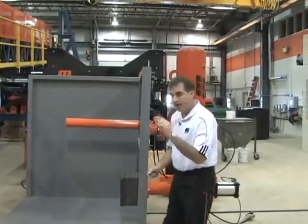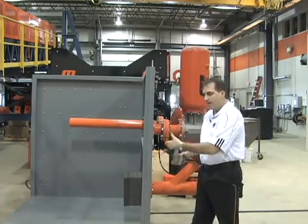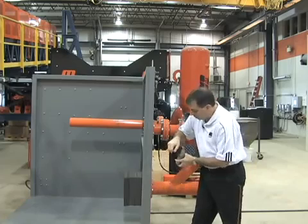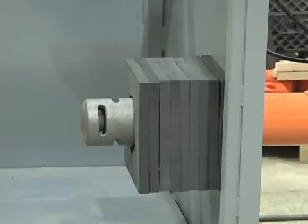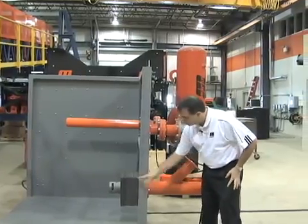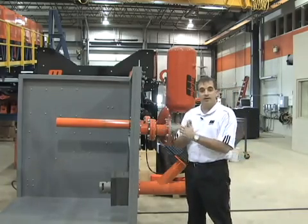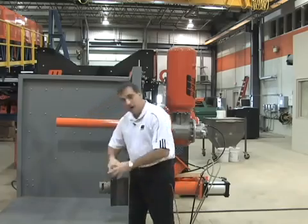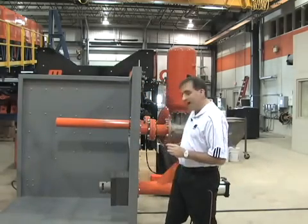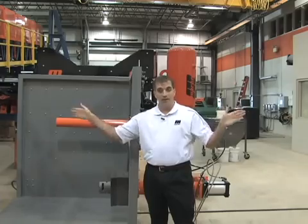It's a 360-degree nozzle once extended. I'm going to extend it for you here — bear with me. When a cannon is ready to blast, the PLC control would send a signal to a solenoid, which would in turn extend this nozzle. That nozzle extends and lines up the inner tube — connected to the tip — with the blast port of the cannon. Another solenoid actuates the cannon just as in every other application; the cannon blasts and the air is dispersed out all four holes. Using the 150-liter tank Martin Hurricane Air Cannon, that blast pattern is around a six-foot diameter — 1.8 meters.